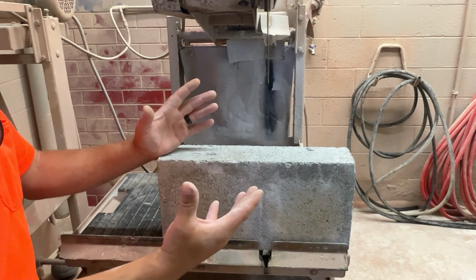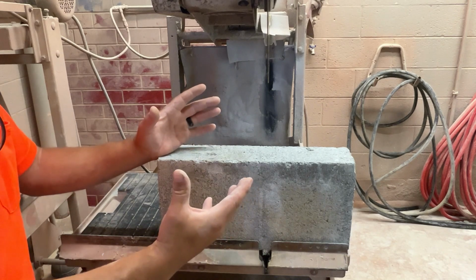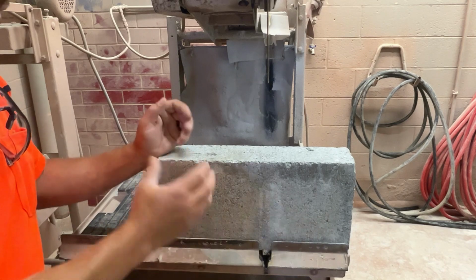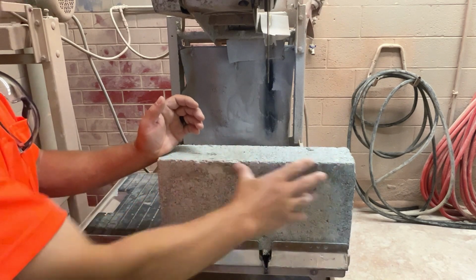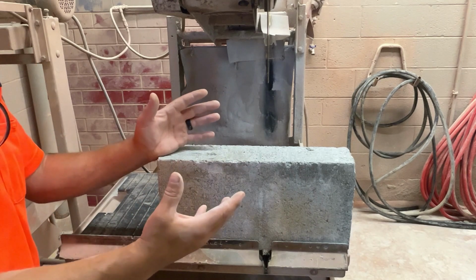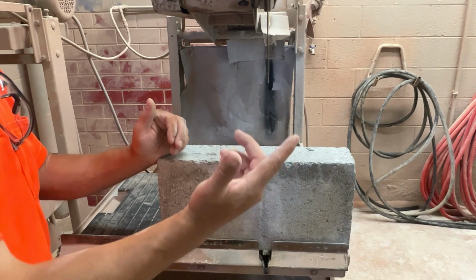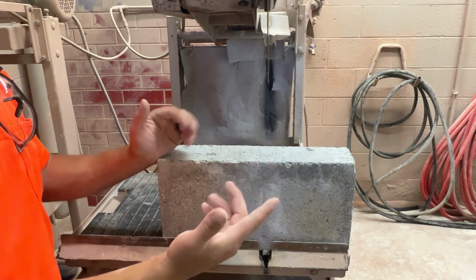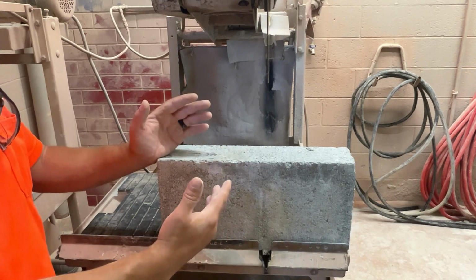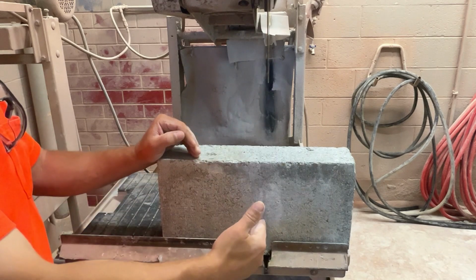That 7 3/4 isn't exactly what we're looking for. We would like to have 7 5/8 inch pieces. These pieces are going to be 1/8 of an inch bigger than what we would like. We're going to make up that difference in the very first head joint that we build on the lead. This is a fast way of getting 2 halves. We're getting 2 blocks with 1 cut.